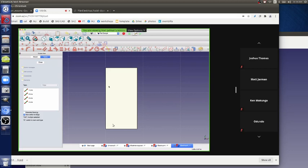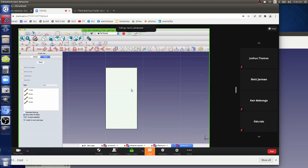There are other reasons, like we're using overlapping on interior panels for very clean edges, so we don't want to put the panels on until all the frames are up. Also, because we're putting the framing in, you wouldn't know where the studs are if you put an interior wall panel against the outside. So that's another reason to keep the interior paneling off. The code inspection is the number one reason if we talk about building this in real life, because there's an electrical inspection and they inspect your rough electrical.